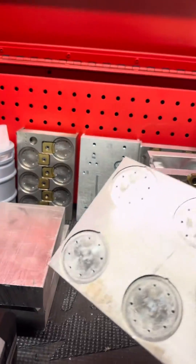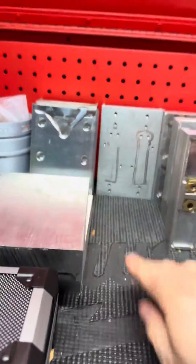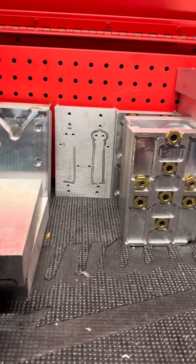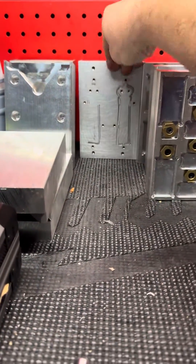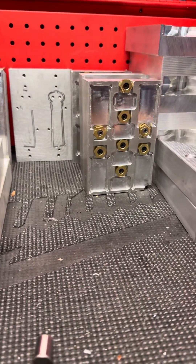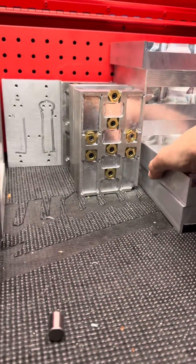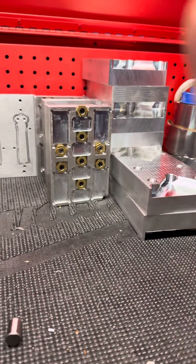I can turn those pallets into various work holdings per product, so that when I just need to make something, I just throw a pallet on the machine, hit the file and hit go. And when I'm designing new products, throw a pallet on, hit go, and I have it saved in my CAD library. Great solution if you need space and want a cheap zero point system — this has been fantastic.